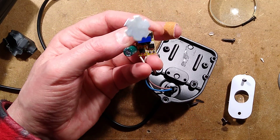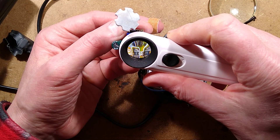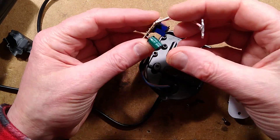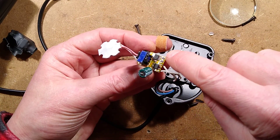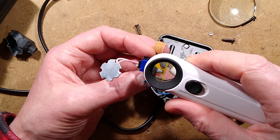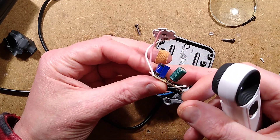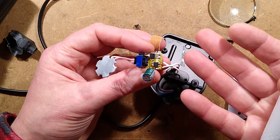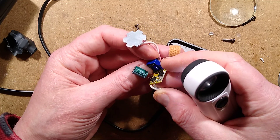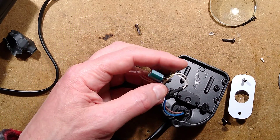Let's open the power supply up. This is probably going to be one of the Bright Power type LED driver chips — so many of them are, though there are many copies now. Let's stick a finger across the capacitor first — yes, it's fully discharged. The chip marking is HA3021. Basically it's a single driver chip without much circuitry associated with it. There's a coupling capacitor, a sense resistor, a control resistor, a diode in the output, and a tiny little capacitor. A 4.7 microfarad 400V capacitor — it's just a basic simple switching supply.